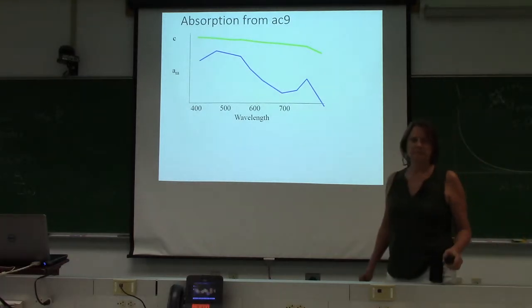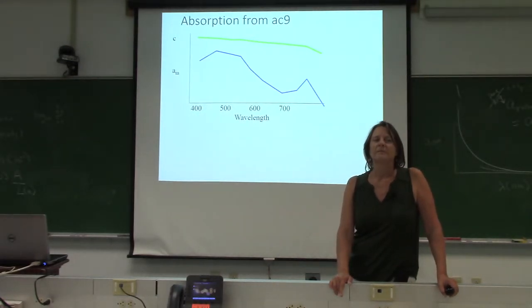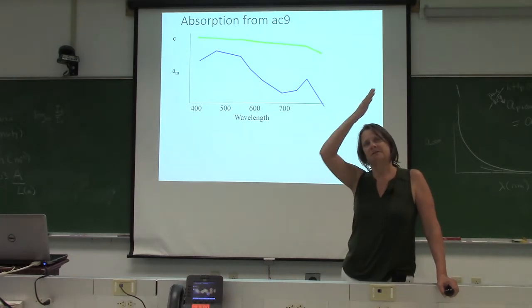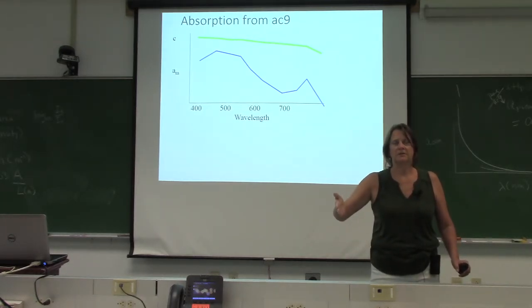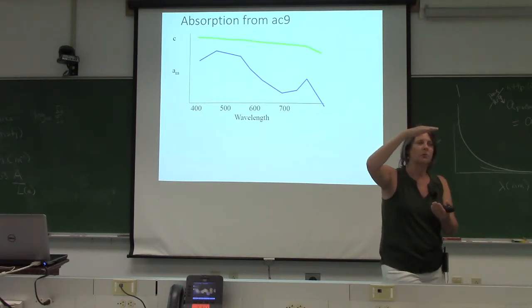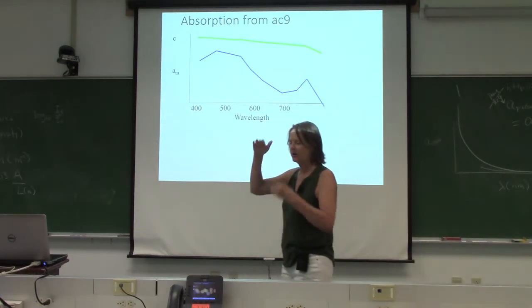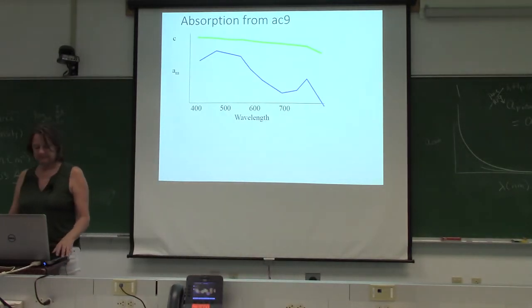And Andrew Garner, in earlier work, showed you can use it to realize what the delay is in the water between your CTD and your AC meter. Because you have a CTD on the rosette, or whatever platform you use, and you have this instrument, the delay in temperature between the two profiles, the difference in the position of the thermocline, will tell you how much you're delayed in time between the two instruments. So you can now align your features in the right place. And also, if you have a really strong thermocline with your CTD and with your absorption meter it's smoothed out, it's telling you that the residence time of the water in your AC9 is spread out, so the features that you're seeing are also spread out. So it allows you to back-correct and get really sharp gradients.